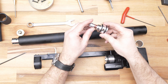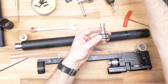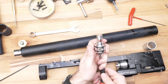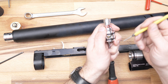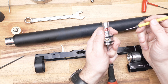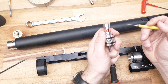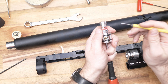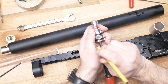Inside the tube on the other side you can see a special sleeve and inside is a regulator. A lot of customers ask how to increase pressure on the regulator. You can use a standard screw — hold it and turn it clockwise to the right to increase pressure, or back to the left to decrease pressure. We set up the pressure at the factory at the best position balancing air consumption and power, but you can adjust it as you want.